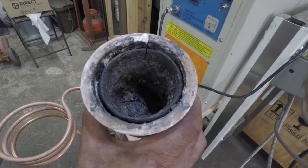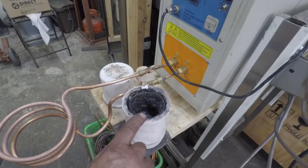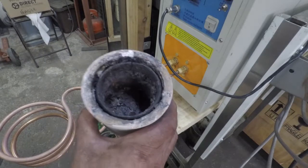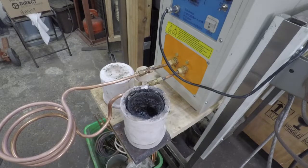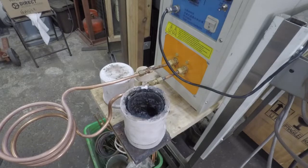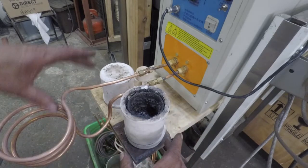What I'm going to try and do is make something a little bigger than that out of fire clay, and maybe some grog. To do that I want to build a mold to mold these with clay, and to do that I'm going to CNC cut bits of plywood that stack up into half of one of these.